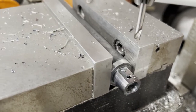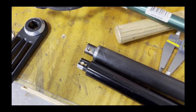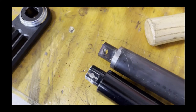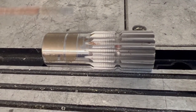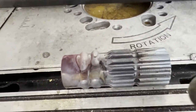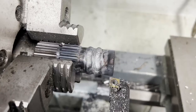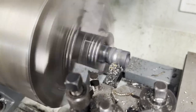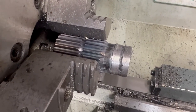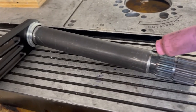A hole is drilled for an extra safety screw that goes in to hold the forks. Hey, a perfect hollow steel copy! Now to make the gear spline fit in the top of the tube, we're going to have to go ahead and use the metal 3D printer to increase the diameter slightly for that nice fit into the tube. This tube goes on the lathe to turn it down to the right diameter, then cut the tube to size and weld it all together.